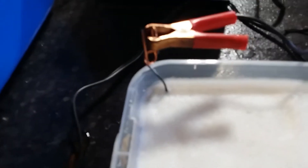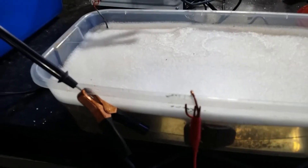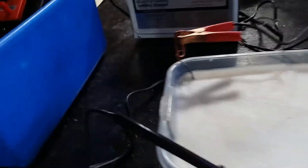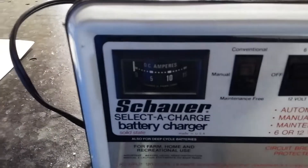You can attach a battery charger — 6 volt or 12 volt, it really doesn't matter. You can even use flashlight batteries; a couple would be enough for this process. However, if you have one of the newer smart battery chargers, it may not work because if there's no battery load, it won't output power. You'll need an old-style charger. I found this one at a yard sale for five bucks, still in the box with all its instructions.